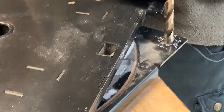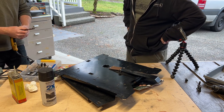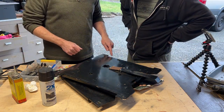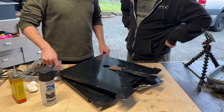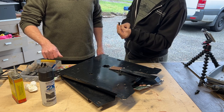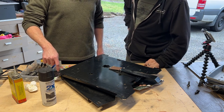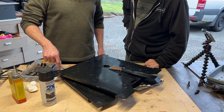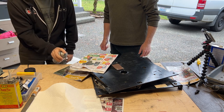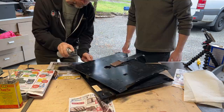Don't try this at home — we won't put ourselves at risk. It'll be harder on these because these are ovals. This is the hole that has to align because it's countersunk, and that's the most difficult one because the guy at Thermo King used a power tool to drive it back in without it lined up right — he cross-threaded it, so there are double the threads. We can't do much to that because of the countersink, but if we can align this one when mounting it, the rest should give wiggle room since they're ovals.